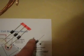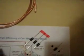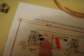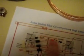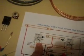That's what the line actually represents on the schematics. It just means that the potential will only go one way. The potential will not go the other way. It will only allow about 0.4 volts of potential to go the other way. Basically, it's blocking potential from going the other way. So that's what the diode means. When it shows you the diode right there, it basically means you want to connect it this way, so that the silver strip is oriented like that. So you connect that between the bus wire there, and then you connect that to the collector of your transistor.